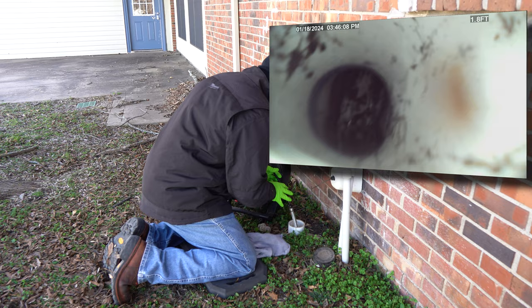I'm going to go ahead and clean the reel off as I bring it back in. The good thing is we didn't see any sewer breaks, which means good things for us. We didn't see any flies when we opened it up this time. I love the Milwaukee cameras because when they're in you can trace the entire line. Had there been a break, we would have been able to go get the locator and find out exactly where that is. If we saw any roots penetrating, we could locate it with the locator and the transmitting signal on the head of this camera.